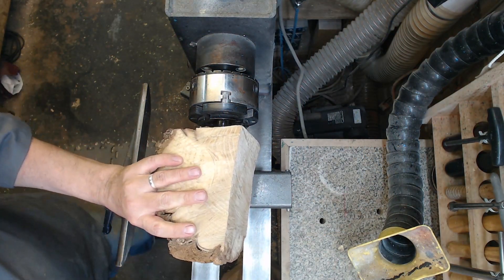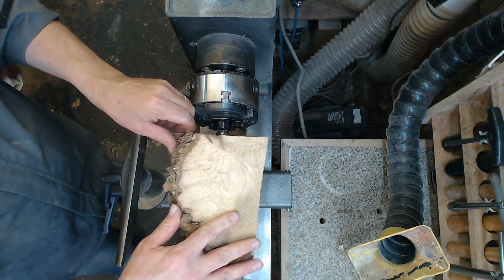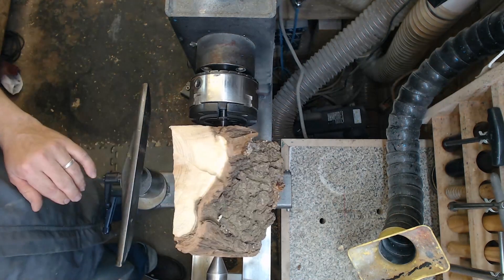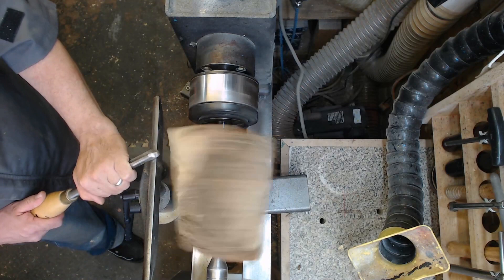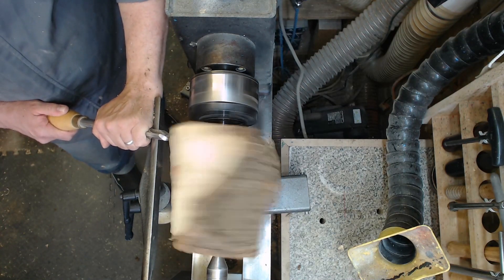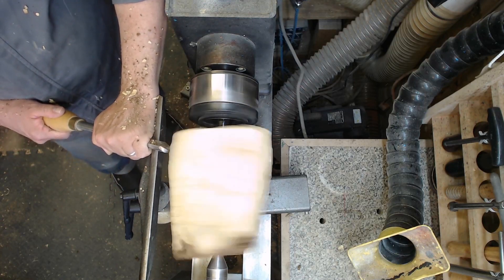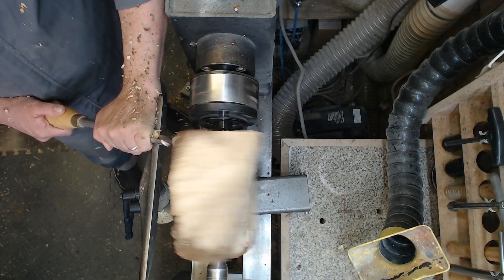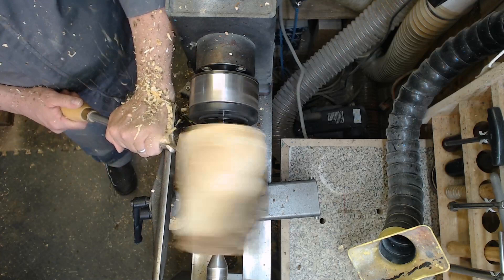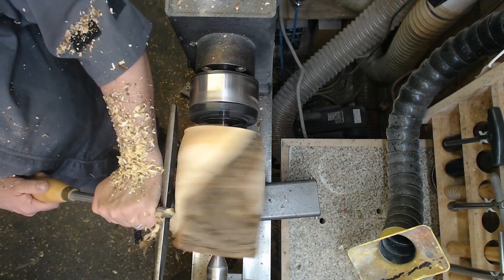So here we are — that's going on a step centre, held in a chuck, and I'm going to bring up a ring centre. Off camera I'd sanded a flat at the live centre end so that it's a bit more stable. It is quite soft where the bark is going in, and better practice would have been to drill a hole down into the solid wood. But I'm turning it at quite low speed and kept checking it was secure between centres. I've used a draw cut here mainly because it means I'm not in the firing line of the blank — though I am in the firing line of the chips, as they're all hitting me on the stomach. Standing to the headstock end means that if something were to go awry and leave the centres, it would fly into the space in front of me. That's the theory anyway.